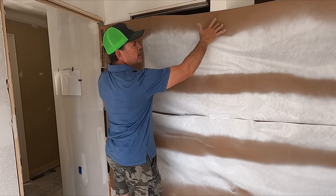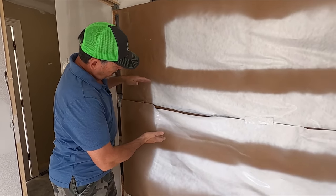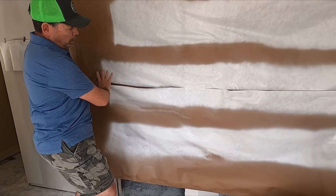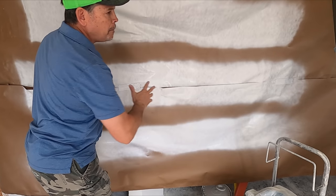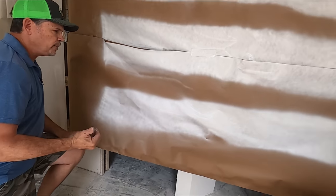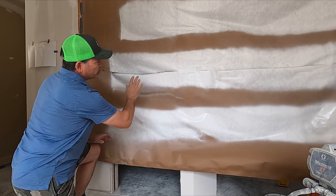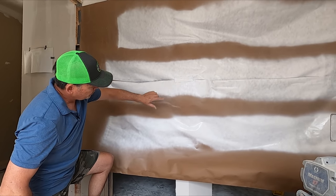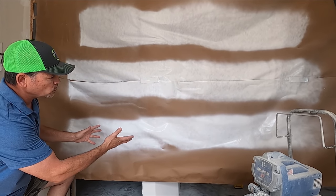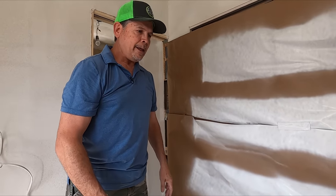The paper's not the best — it's kind of bouncing around — but we didn't want to paint these walls yet, so the paper worked fine. Our next section: old tip, brand new filter — much more product on there, much better coverage, and it is still drying. And our bottom one, of course, new filter and brand new tip — not nearly as spotty. This one looks like a leopard, you can see right through it. This is much more even — it may not come across that way on camera, but right here where Jordan and I are, we can tell it's a much more even coat of paint. Super happy with that.